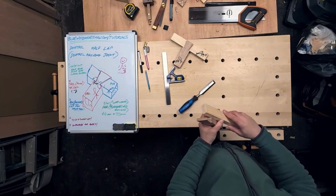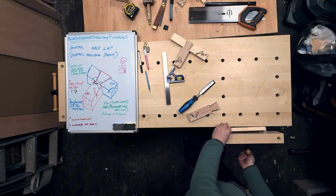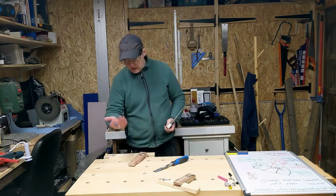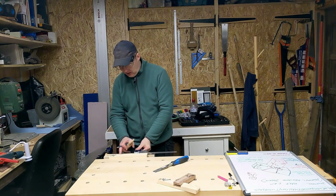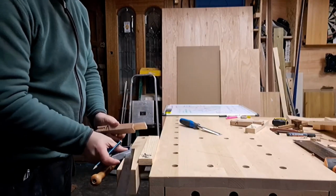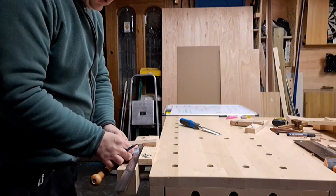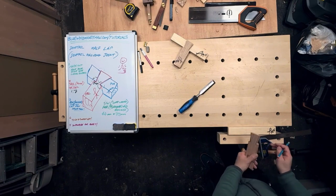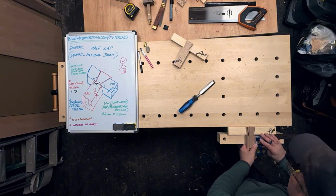We did our lines where it's going to go around, and I'm going to use the vise again with this and our combination square. So I'm going to take the combination square and run that down so that's square. At this stage, get your pencil, put your combination square or your tri-square up against the edge of your pin timber. If you wanted to do it on that side, you could do it on that edge and then on this edge here. So both our edges, and we're going to put the tail up to the pin. Instead of trying to hope that our shoulder line is square, we're going to make it square with the combination square or a tri square. Put it up to our lines there.